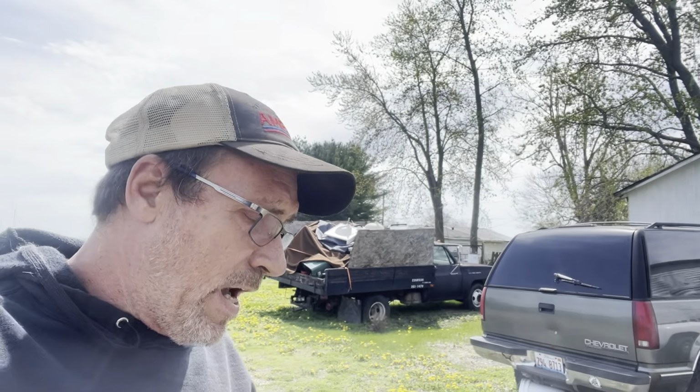It'd almost be nice to have a bigger back sprocket on that bigger lower one behind the wheel, because the one on the transmission's already, I can't get one too much smaller than that on there. A few bugs to work out, but I think mainly it's going to be front tires and changing the gearing, and then of course getting brakes on it.